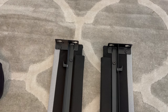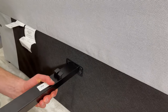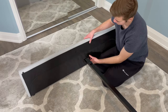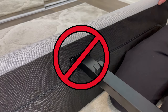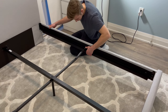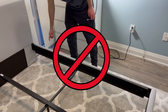Now grab the middle structure and the headboard — it doesn't matter what orientation you put the middle structure in — and attach the middle structure to the headboard like this. Just make sure you don't screw the screws all the way in. Now grab the footboard and attach it to the middle structure as shown, again make sure you don't tighten the screws. Now go to the right side and attach the right side panel as shown — this part of the beam should go underneath the right panel. You may need another person to help in this step, and again don't tighten the screws on each end.